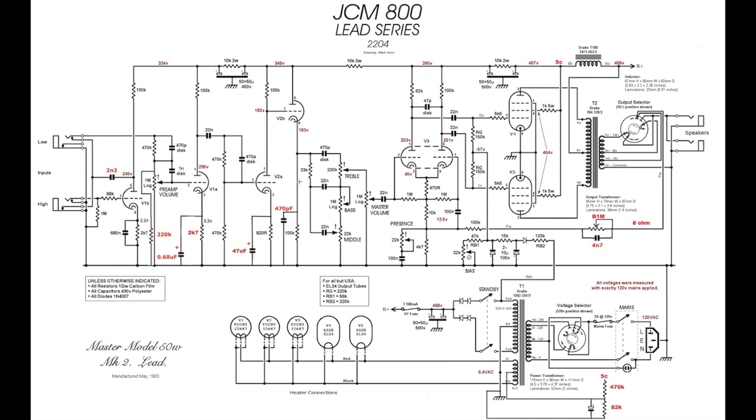This is your cathode follower, as I mentioned, that's driving the tone stack, and we've added a 470 picofarad cap to ground here. What this is doing is bleeding some top-end frequencies out of the amp at this point and shunting them off to ground. There are other ways you can do this. You'll see amps where 470 picofarad or less is typically added to a plate resistor up here, or an anode resistor. That's a different way to do it, with a slightly different result, in a different part of the amp. But what we're doing here is adding that right at the end. This is optional, right? If you really want a lot of brightness in your amp, you can leave this out, and compensate with your presence and your treble. But it helps to keep the amp a bit more under control.